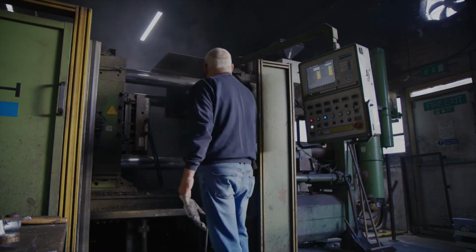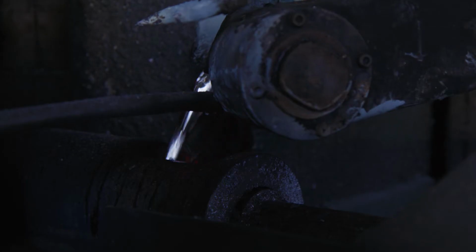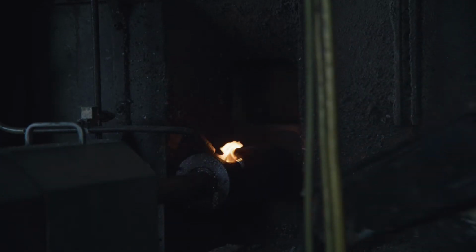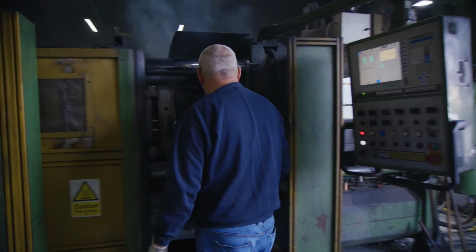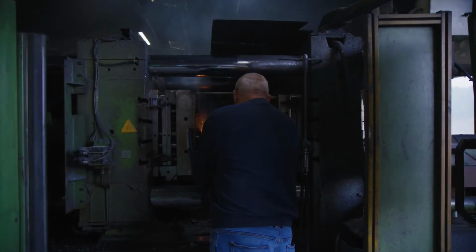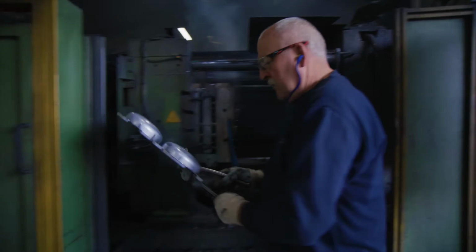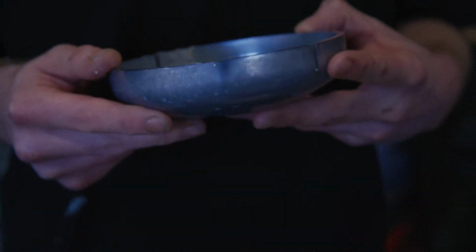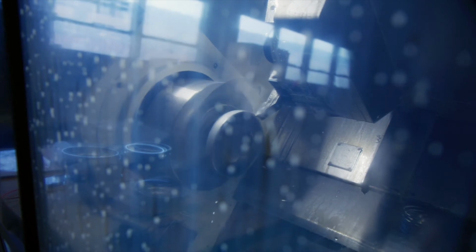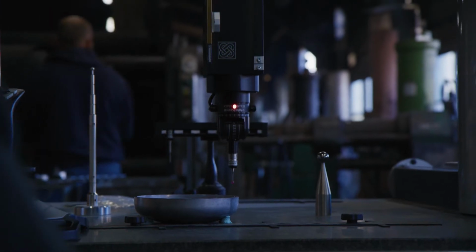The first most important bit in the casting process is temperature. So we're looking at the temperature of the tool, the injection pressures, the actual timing of the first phase, the second phase, the third phase, which then impacts and actually pressurises the casting during its solidification process and compresses it so it's a nice solid gong. We completely machine the gateway using a diamond tip, and it is literally as if it has been made with no feed points. You've got to test product continually, every one ideally.